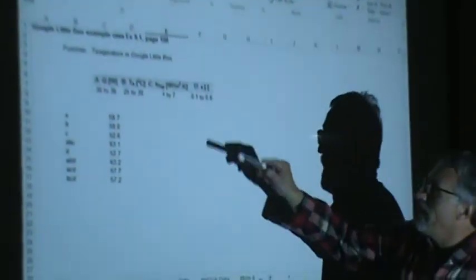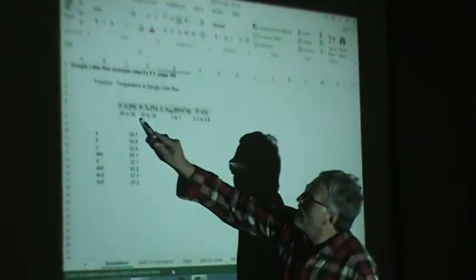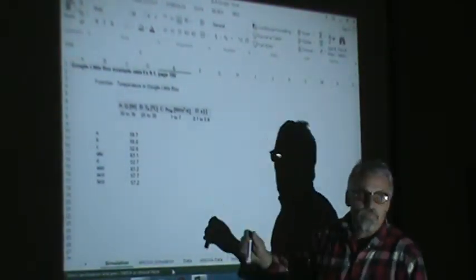And then my emissivity, 0.1 to 0.8, that's a hard one to nail down, because that depends on is it aluminum? Is it anodized? Is it roughened? Did it get some slimy grease on it? That's a real wide range. So here's my low and high, low and high, low and high, low and high. So there's my two levels for each of my four factors.